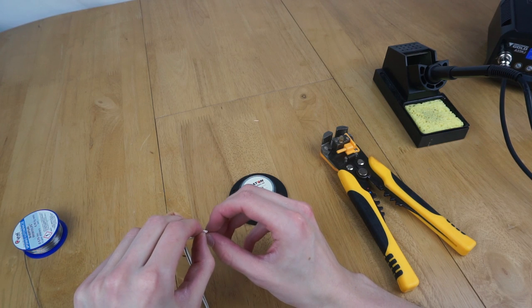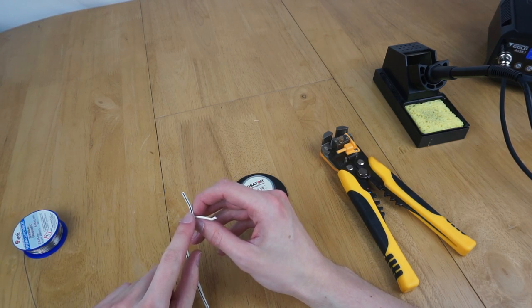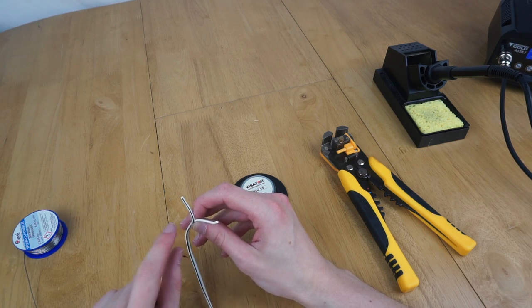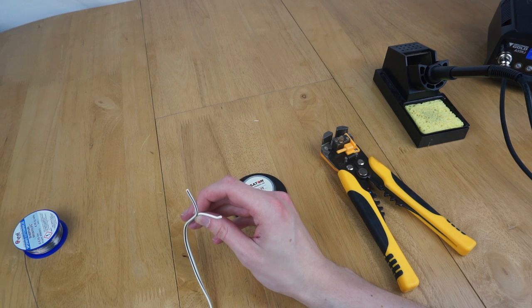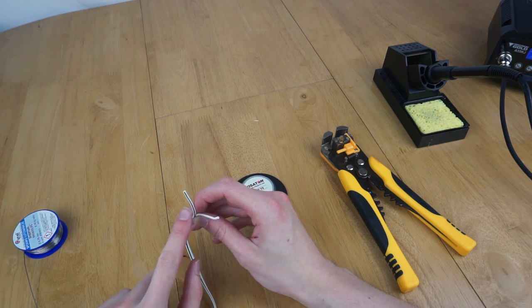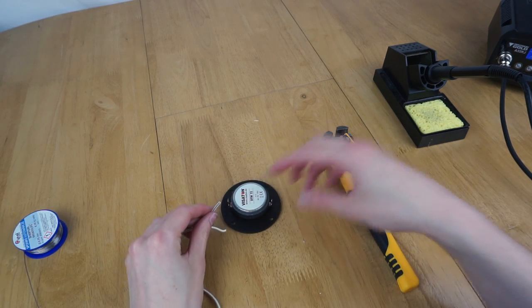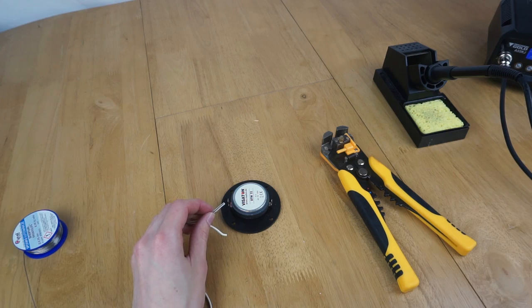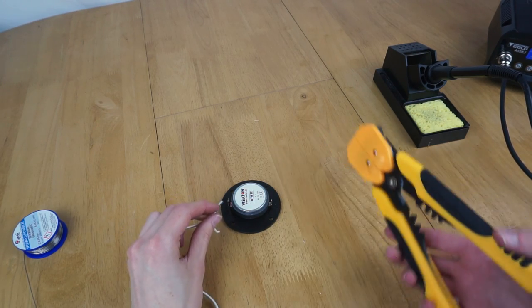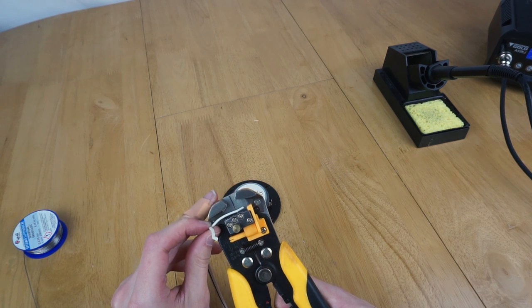Now, one thing I'm actually going to do is probably going to look slightly wrong to everyone, because I'm going to use the one with the wire with the stripe on it as the positive. In every setup when you're doing this properly, that should be the negative, but throughout the Coomber they've used it the wrong way around. All the positive stuff in the Coomber has the stripe on it. So I'm going to do it that way, just so it's consistent at least, so I don't need to remember this part of it is wired the right way around, the other parts are the wrong way around. I may as well just do it correctly for the whole thing. Or do it incorrectly for the whole thing. At least keep it consistent. So yeah, that's why I'm doing that.